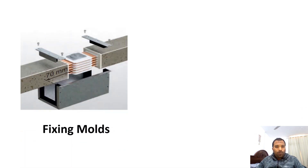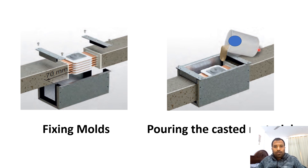Consider bus bar A and bus bar B being coupled together. From the center, maintain 70 mm and fix the mold in place. The mold contains rubber gaskets on both sides to seal it. After fixing the mold, immediately pour the stirred mixture inside from the top. Use rubber/soft hammers to keep knocking the mold so the material fills inside completely. Ensure there are no bubbles inside the casting.